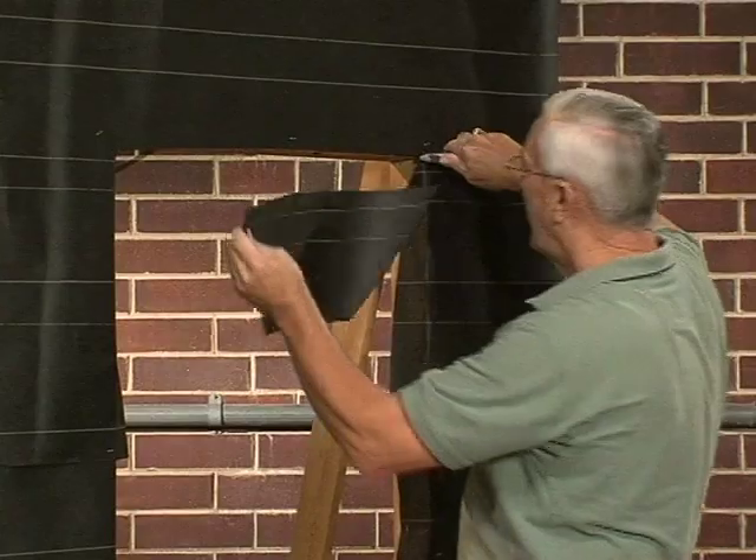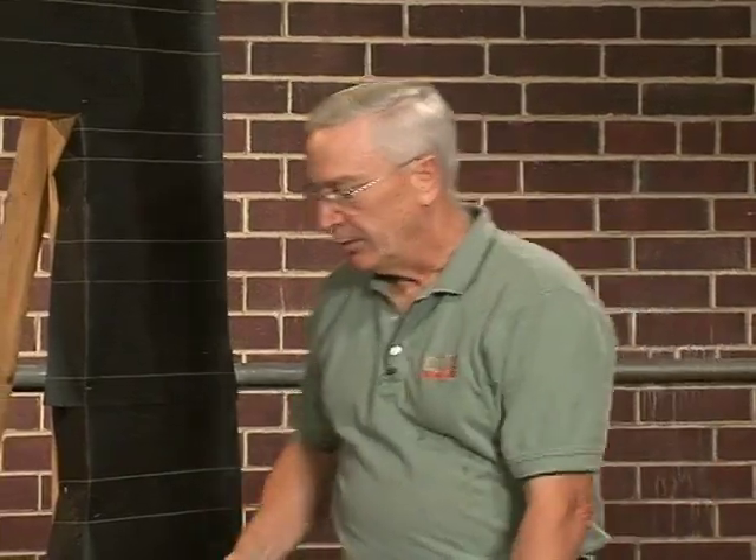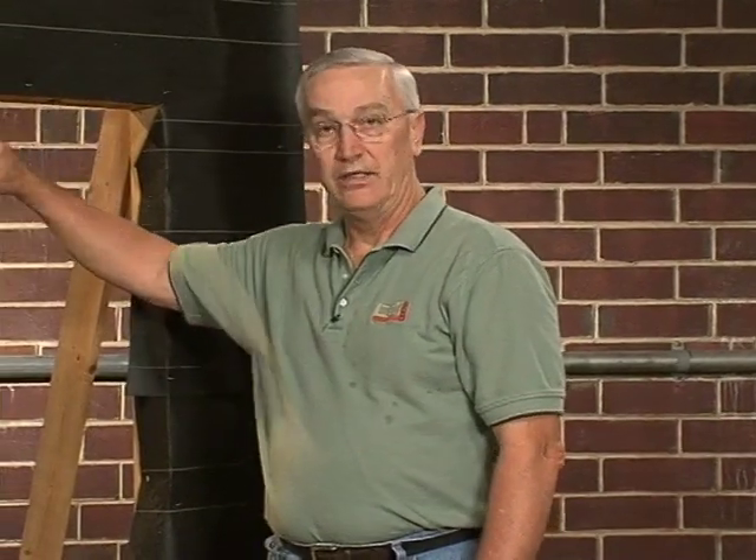So we always cut this top piece off flush. We're going to have a piece of flashing here at the head anyway in just a few moments. Don't turn that top piece of house wrap, tar paper, or whatever you're using for house wrap, into the window head.